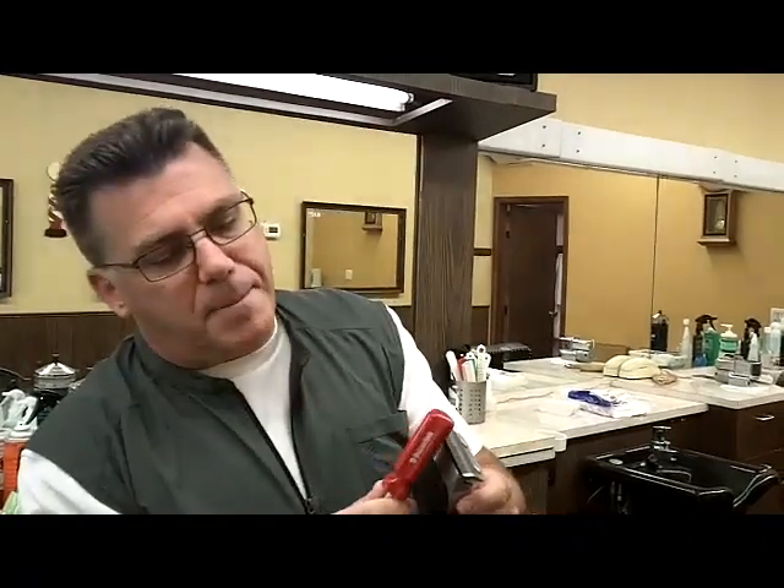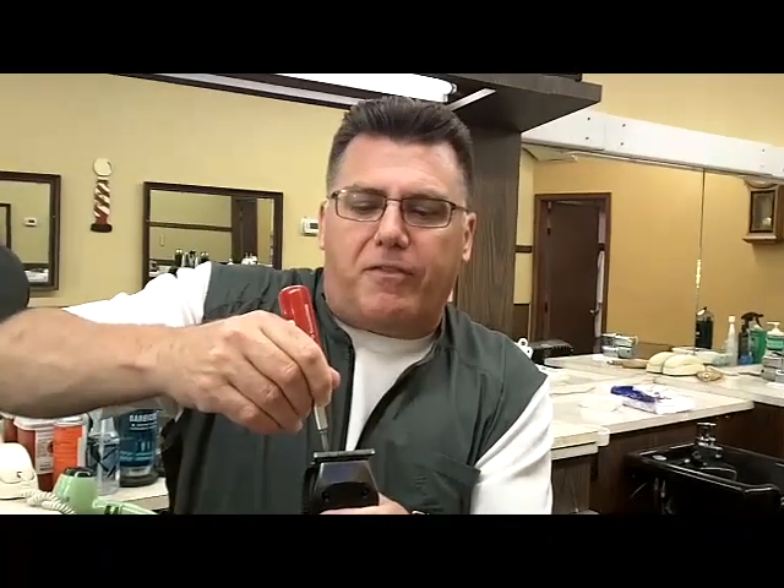Loosen the two screws on the back of the blade, wiggle the blade into place, and walk the screws down. If you tighten one screw all the way to the bottom, the blade will kick or swerve. So walk them down, and when you get them down to the bottom and snug, I like to use the handle of the screwdriver to tap the blade as necessary, just a little bit to get it right where I want it. Then go in for the final tighten, and the last thing I do is check it again.